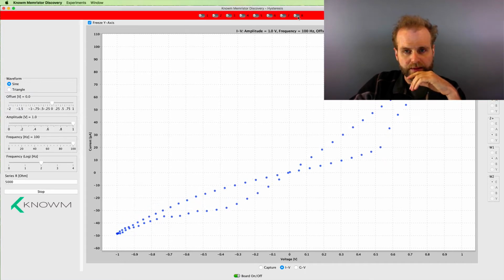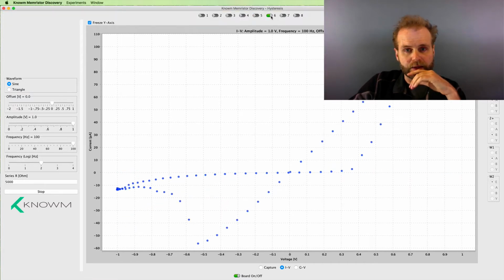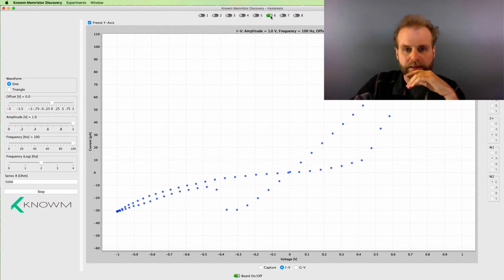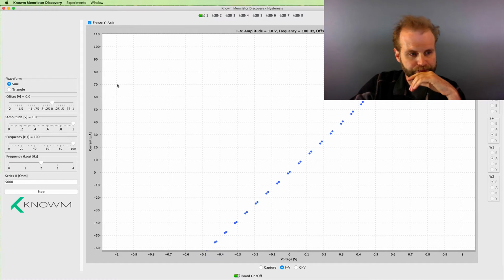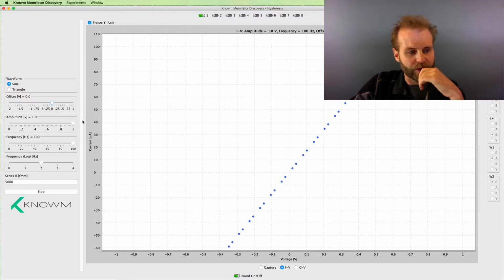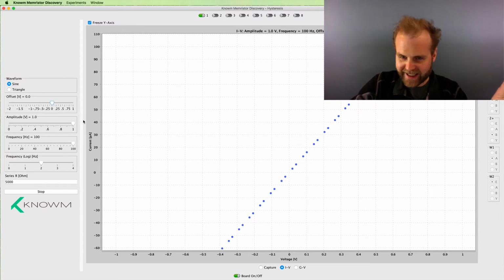Now, the reason why this could be problematic is if other devices are much more conductive than that one, because then there's a variance to it. In this case, it does look like we have brought it in line with the other devices. Let's check out device 1. Again, it looks like we have gotten stuck. And why is that? Well, we put the 5K ohm back in. Notice that we had a perfectly good device when we had a 1K series resistor.